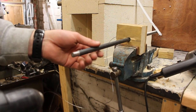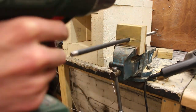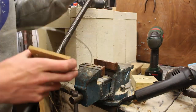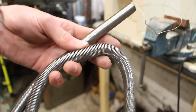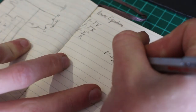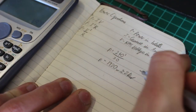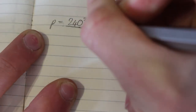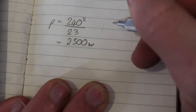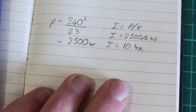Once I've wound the coil I release it from the drill chuck and it springs open and unwinds a little bit but still keeps its overall form. Then it's really easy to dismantle the wooden block, slide it off the rod, and now I've got a really nicely tight wound coil. My heat treat oven is going to have a total resistance of 30 ohms in the coils - two 15 ohm coils on each side connected in series. Using simple physics formulas you can work out that the power is going to be about 2 kilowatts and it's going to draw about 8 amps from the wall. Looking back I think these 2 kilowatt coils are slightly underpowered - when they burn out I'm going to replace them with 23 ohm coils, giving about 2500 watts drawing 10 amps instead of 8.